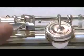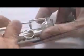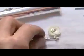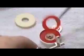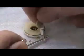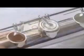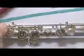They test each key's seal, called the pad, for air leaks. A thin strip of plastic slides out if it's improperly sealed. The pad is made up of a plastic washer and a felt cushion surrounded by a synthetic wrapper as thin as tissue paper. A pad lasts for about 5 years and is very expensive to replace, about $90. It's just one of up to 100 components in a flute, depending on the model.